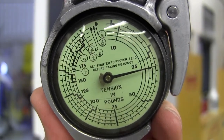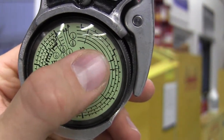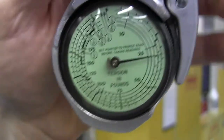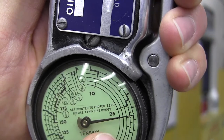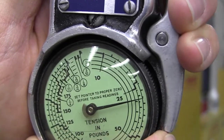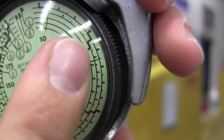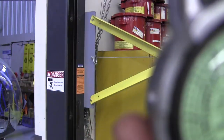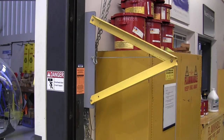As I'm looking at this reading here I can see it's somewhere between 25 and 50, and I'm looking at this second row. We need to figure out what each of these hash marks represents — 25 is obviously there and 50 is right there. Let's guess that these large marks are five, so: 25, 30, 35, 40, 45, 50. Each of the heavier lines is five, which means each of the smaller ones in between are two and a half. Our needle is at 25, then 30, and that's 32.5 — so it looks like I'm right at about 31 or 31 and a half pounds. I'd say that's right at about 31 and a half pounds of tension, which is actually pretty close to what I set it.